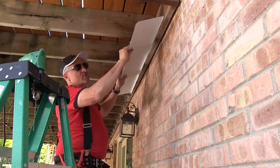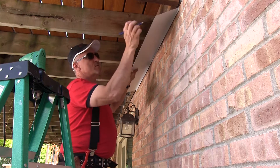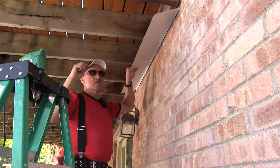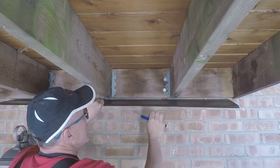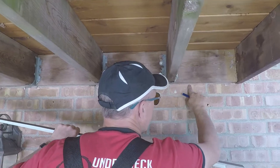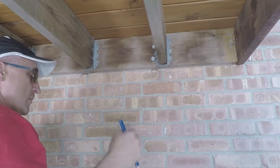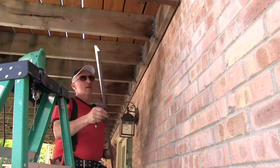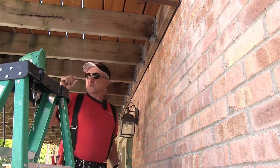I've already marked it above so I know exactly where I'm going to attach it, because after I've got this up there and sealed it I can't really see exactly where I'm at. I'm lining it up where it's going to go — this is just about that far underneath the ledger board. But I've got an uneven sealant surface here, so I've got to be really careful and do a good job. I'm going to put sealant on the back of this after I've pre-drilled the holes.